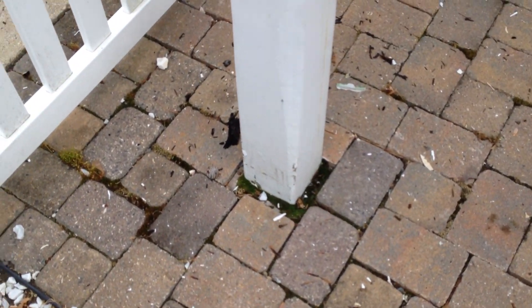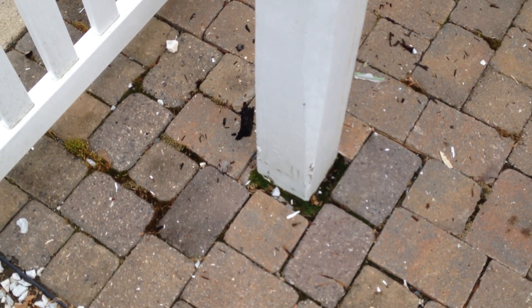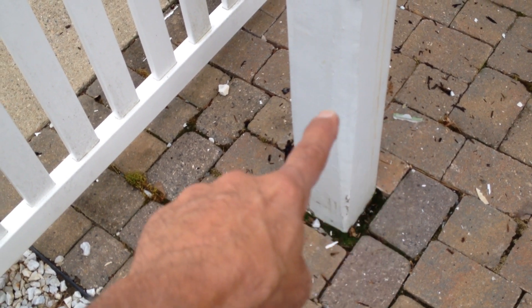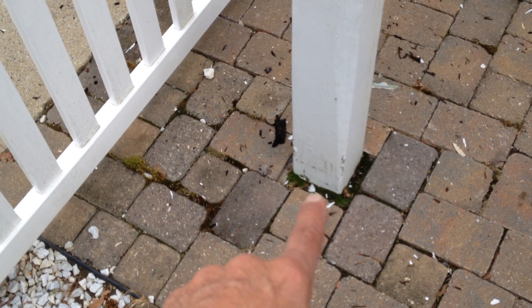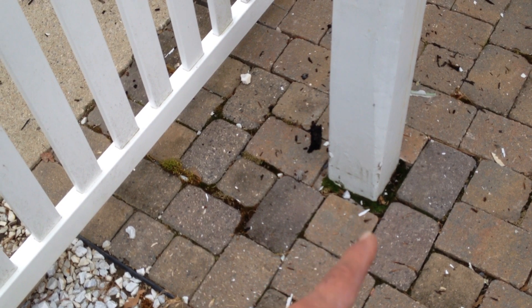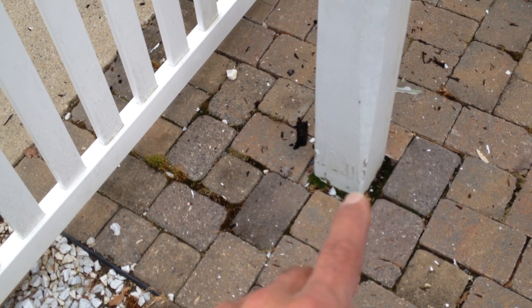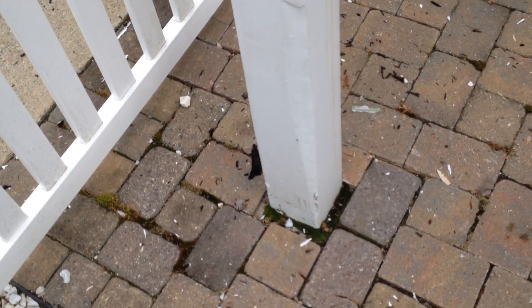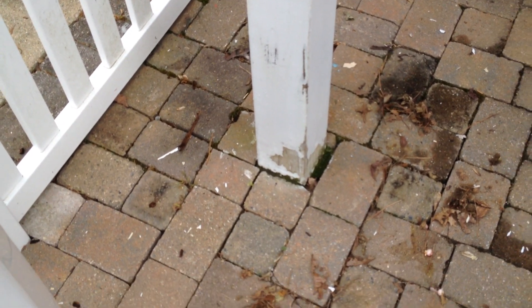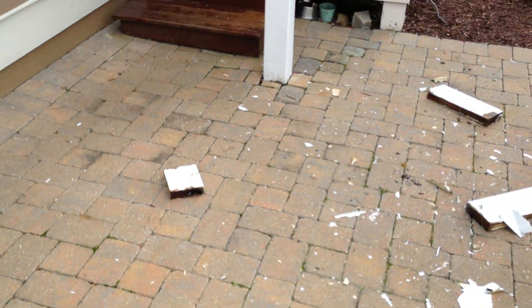This is going to be a fast job. My only problem is what to do with these posts in the ground. I've already told the homeowner I'm just going to cut them off below. I'm going to remove a few of these stone pavers around the base, then flush cut it as best I can and grind whatever I need to grind down below the brick. Then I'm going to plug these with concrete — some Quikrete. That's the cheapest way out instead of digging them out, because you know they're concreted in.